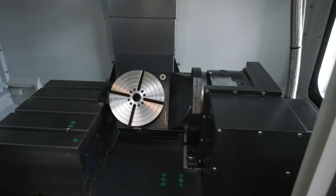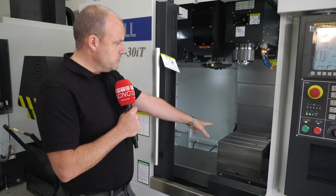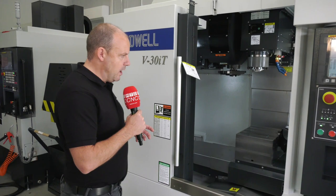Now the great thing about this as well — some of the differences with this now — the clamping motion on this table is now hydraulically actuated, so it's a really firm fixture when it's in position. Also, you've now got a support on the end of the fixed table, which means you've not just got the driven end, you've also got full support, so it's a tilt-turn kind of between-centres as well.